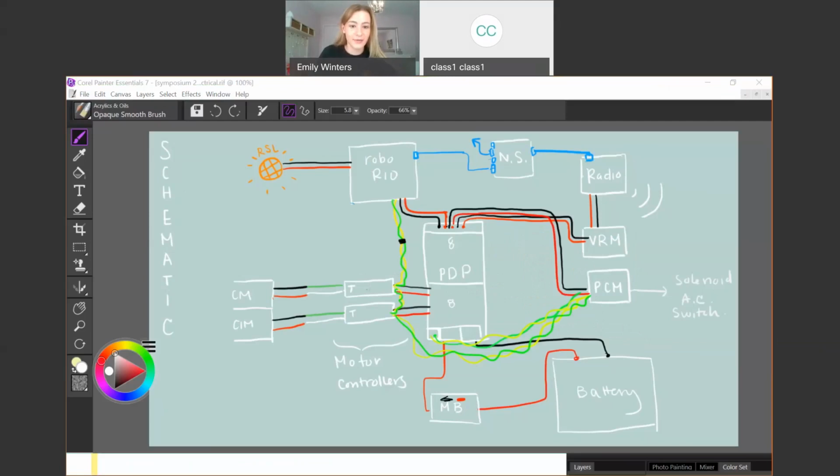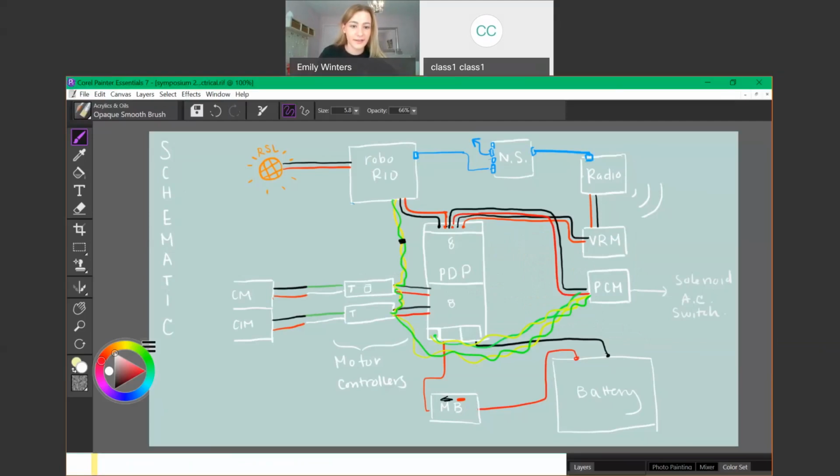So the Talon has a little port on the top right here. And so we're going to place the IMU just over here. Since it does measure your robot's position, you normally want to put it in the middle of your robot, either front to back or side to side, so that when it turns in place, it knows it's turning in place and not moving around an arc. The wires are kind of beige-ish, and connect to a Talon, or also connect to the RoboRIO. I know there is an IMU NavX, and there's a Pigeon IMU. A Pigeon more likely connects to the Talon, and a NavX can connect to either one. So that's one reason we have a Talon.